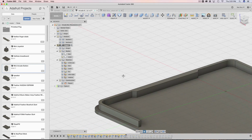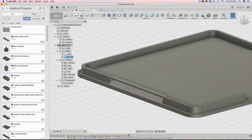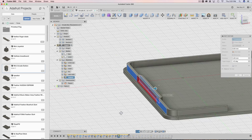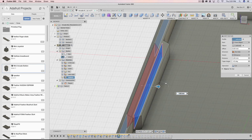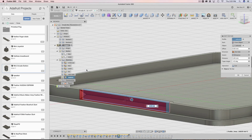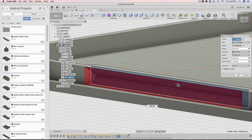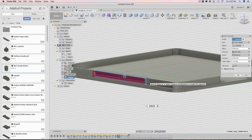The next thing I do is, this is kind of cool. This is really cool, actually. I make an extrusion using the same indent. So what I did was I basically clicked on that. It's kind of hard to see this. So I just selected that nub that we did, or the indentation part, the little section. And then what I did was I set these to start from object, so you can actually use the same rectangle inside of a sketch and then tell it to start from a different thing.